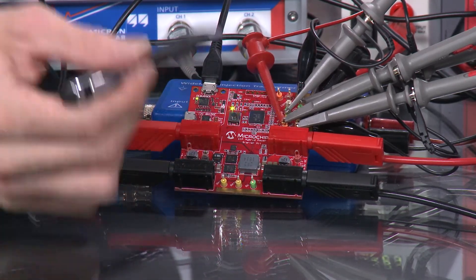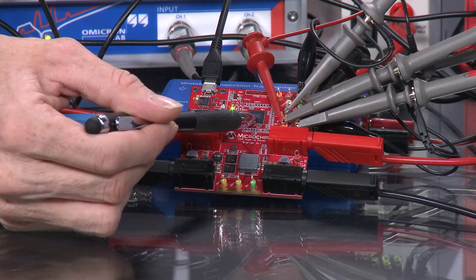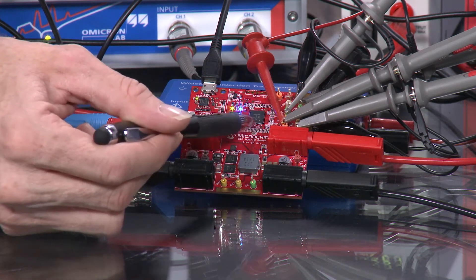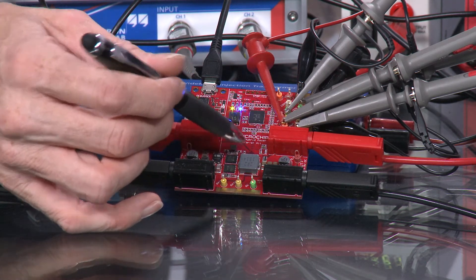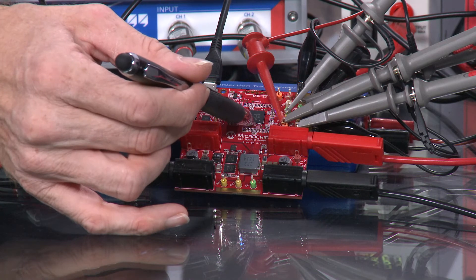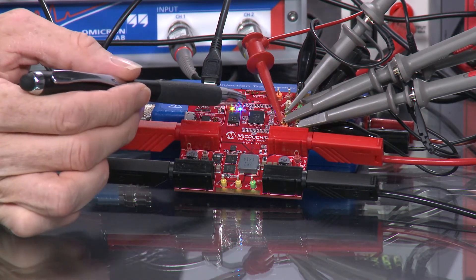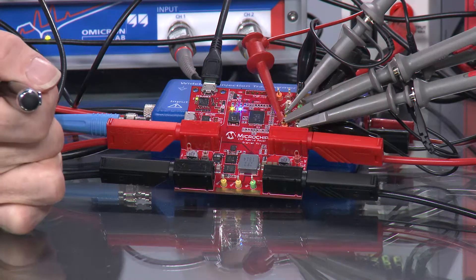The things we need to change: first, we need to install a differential amplifier at two input pins of the device — the two input pins wired to our DCR sensing network, where the resistor of the RC network is located close to the inductor to cut off and limit noise. The capacitor has been moved very close to the device because the voltage seen on this capacitor is very small and sensitive, to prevent the feedback signal from picking up additional noise and drowning into the noise floor.